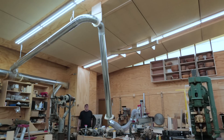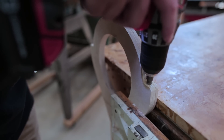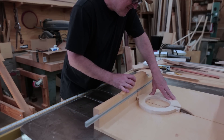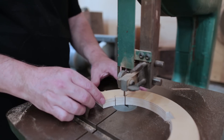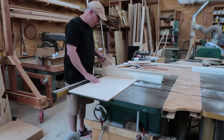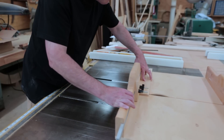It was just a matter of putting it back together again, but it meant a rethink of the design. I thought about using a strip of thin plywood or metal along the lower edge of the beam to hold the wheel in place, but after thinking about it, a better solution would be a set of wheels running horizontally on the bottom of the beam. This would hold the vertical piece and the vertical wheel in place much more solidly without any scraping or rubbing. I also finished the design of the piece that connects to the pipe — cutting it in half and using screws to clamp the circle around the pipe.